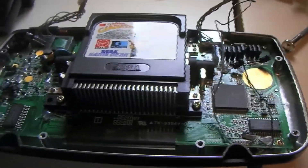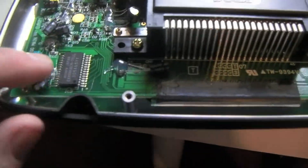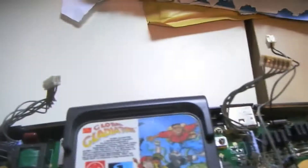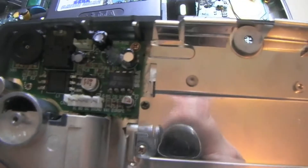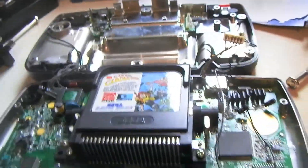And we're back. It's been about a month since I shot the last part of this video. As you can see, I've replaced all the capacitors. I've also dabbed some hot glue because my soldering skills these days are not as good as they once were. I also had to modify the heat shield a bit and place the caps there. The capacitors didn't look too bad when I removed them, however they started to disintegrate and the electrolyte was all over the board, so I had to clean all that off.